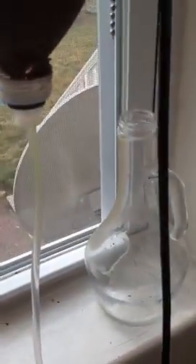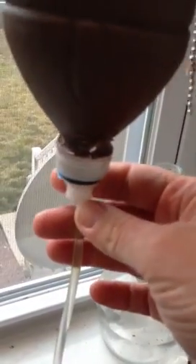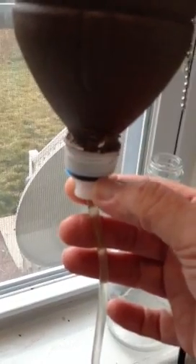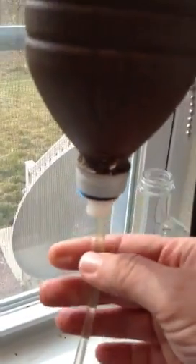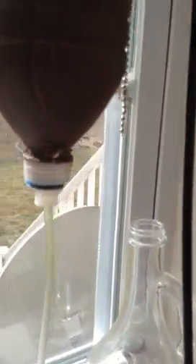The modification I did — I took a suggestion from somebody else, but instead of silicone making the drain with the T-drain, I took a half-inch flat washer from the plumbing section of Home Depot, pushed it through the hole in the middle, and set it right into this groove right here and it sat nice. There's no silicone and it seals perfectly.